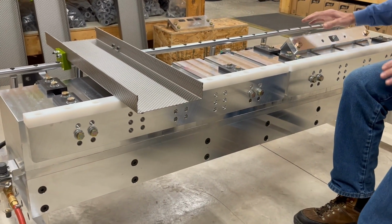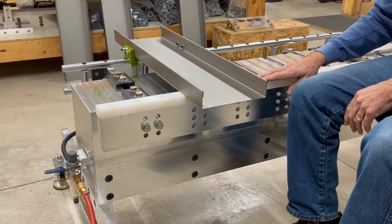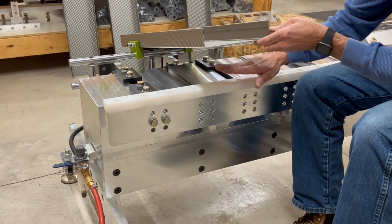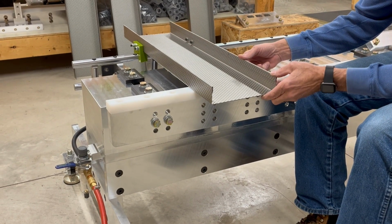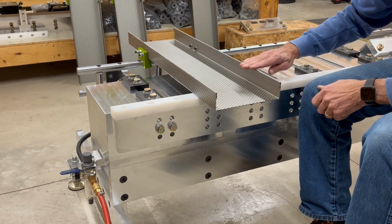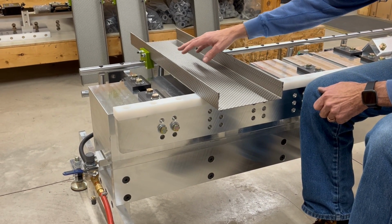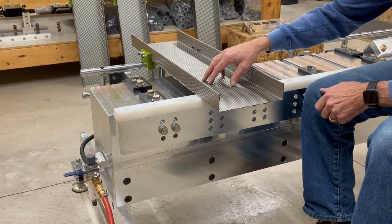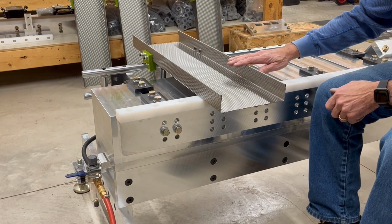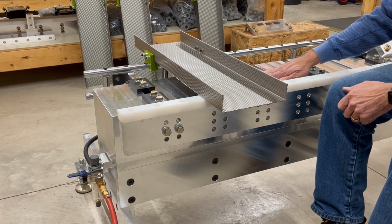But the main benefit of the platforms is to do several things. One, to provide a stable surface for your tray to rest on. Second, to level your tray. When your tray is level, the material in the tray will move more efficiently down the tray. Thirdly, to suspend the tray off any obstructions.